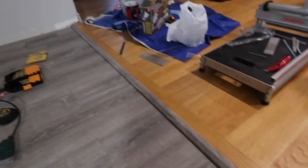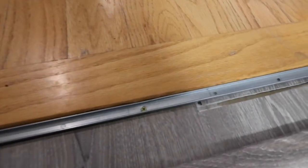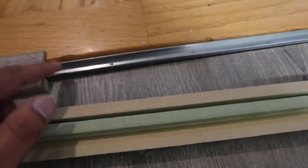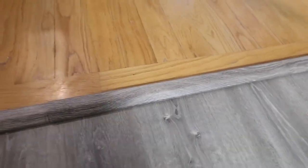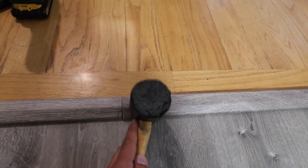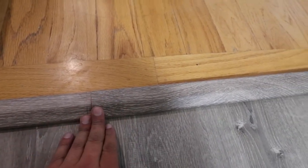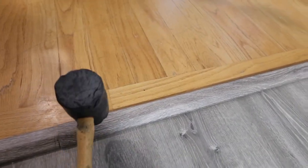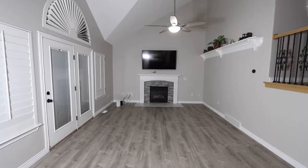The track is in. The multi-purpose reducer piece — the green end sits inside the track. Set it in there and use a rubber mallet, not a real hammer. Tap along the side all the way down; you might have to tap it back a little to close the gap. Take your time — tap it little by little, you don't have to pound super hard.